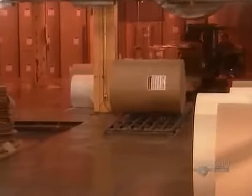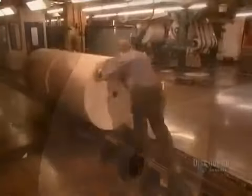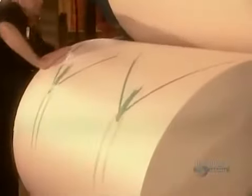The newsprint comes in jumbo rolls weighing 850 kilos apiece. Workers feed several rolls into the reeling machine under the printing press. Two-sided tape connects one roll to the next, ensuring a continuous, uninterrupted run.